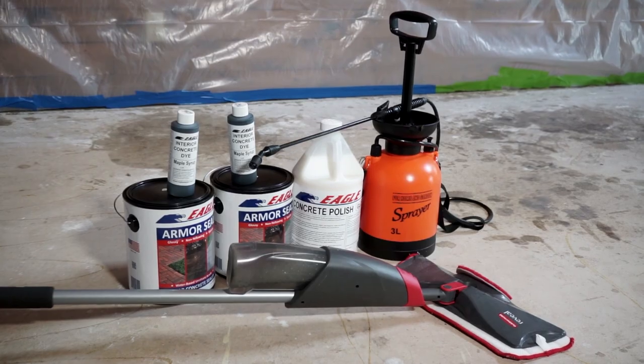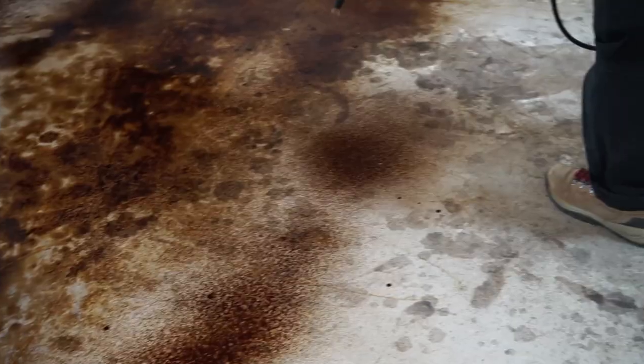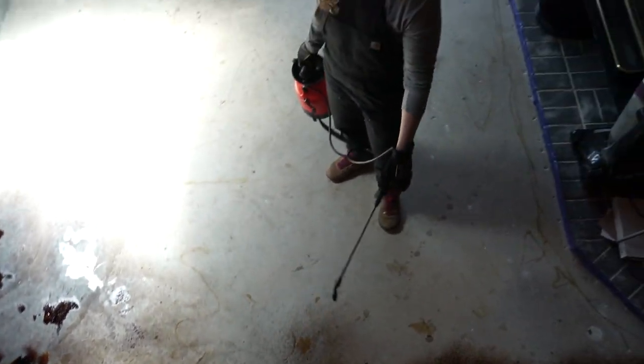These are the supplies you need for the dye — and I'm calling it dye because that's what it is: a concentrate dye you add to water. I opted for a brand called Eagle concrete dye. I chose it because it had great reviews, and it's different from acid stain — acid stain works with the limestone in your concrete and actually destroys a layer of that concrete in the process. If you want that mottled look that acid stain gives your floors, you can still kind of achieve that with this stain. That's why I opted to leave my floor somewhat imperfect — I scraped some foam off the glue but left some of the glue stains to give it that mottled look.